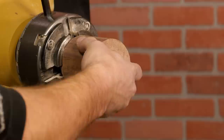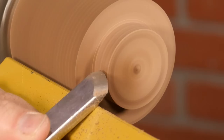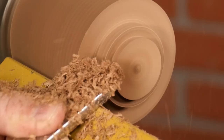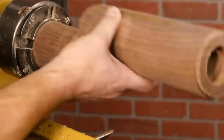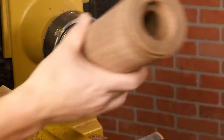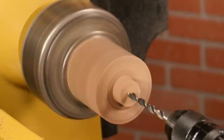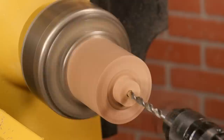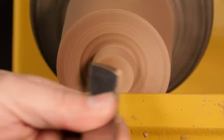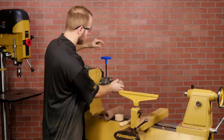Remove the mill body and mount the mill head in the chuck. Square the end of the spigot, then slowly turn the spigot down, testing the fit with the mill body as you go. You want a slip fit that's not too tight or too loose. Once you get the spigot correctly sized, drill a 9/32 inch hole completely through the mill head. Now turn a 1/16 inch deep recess in the end of the spigot to fit the turn plate — this will help center the turn plate during final assembly.